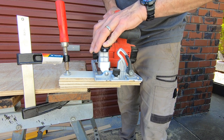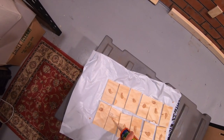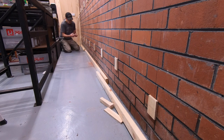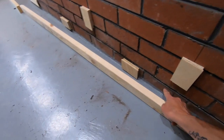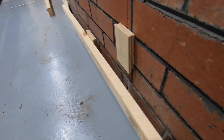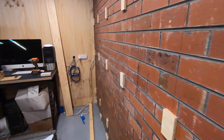These pieces of ply are actually off-cuts from the ceiling panels and wall panels from the first wall. I'm using two different thicknesses to get the exact spacing from the wall, and the next step is to stick the thinner ones over the top. That's them all on there now, and the battens will all get attached to those. Along the bottom, these are like a bottom plate - they'll run along that line of bricks. The floor is not dead straight, it angles downwards, but these will get screwed with anchors into the brick through the spacers and that'll be the bottom plate the ply attaches to.